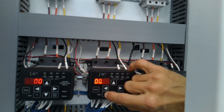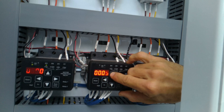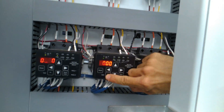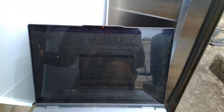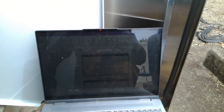Let's change that. Going into function parameter one to raise it up — but 5 is as high as it'll go. That's interesting and not good. So how do we raise that? The manual says it's adjustable between 15 and 100 percent of max amp rating. How do we change or find the max amp rating?